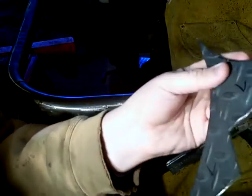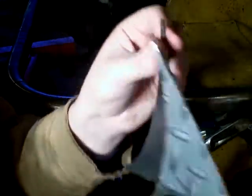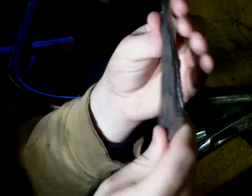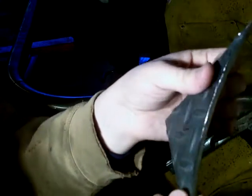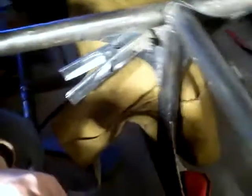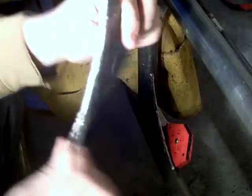Here's what I did: I've got these gussets and I made sure to cut them from the same piece of diamond plate — you can see the outlines up there — so that when you turn it, it looks like one piece continues right to the other side. And that also means the front side lines up the way it should. This is the first one where I've done double-sided: I took two of them and welded along this side so I've got diamond plate on both sides.